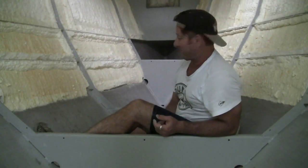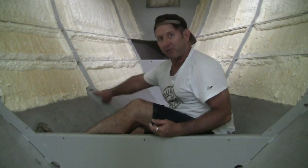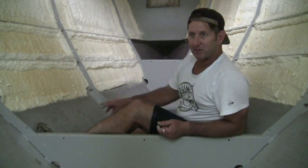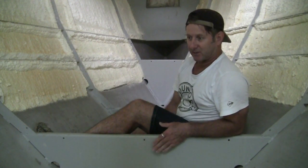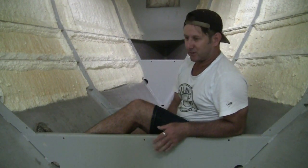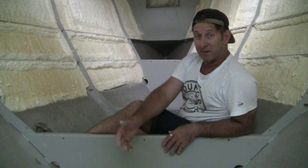Loving the jobs. So just sanding around the frames where I'm going to put the coving to give it some bite to adhere properly, because I will put some high build epoxy 605 over the epoxy coving before I put the top coat over. The top coat really needs an undercoat prime or primer undercoat, so this does marvellously for that.